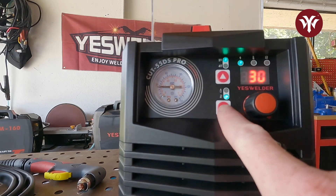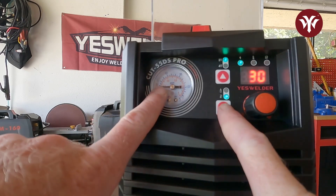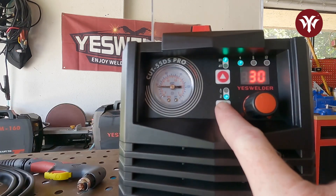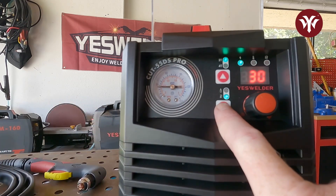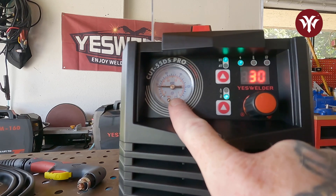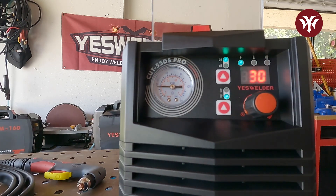We have this button, which I love. Sometimes when you're running air pressure, you're actually going to run less than what you're seeing. So you can push this button — it will push air through the gun and you can see the true number of what you're actually running without running it. Right now it's saying we're running 25 PSI, but in actuality, when the air is moving through it, we're running a little under 20, about 19. So that's a great way to check that before you start your cut. And then lastly, amps — how many we want to run for the thickness of material we are going to cut.